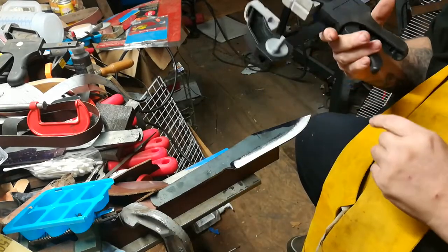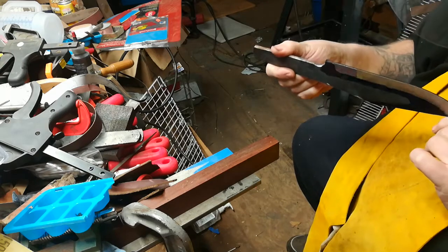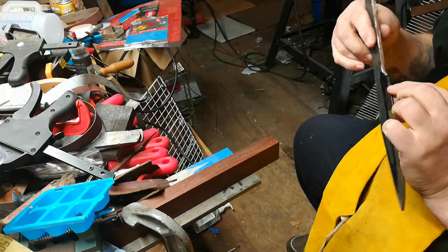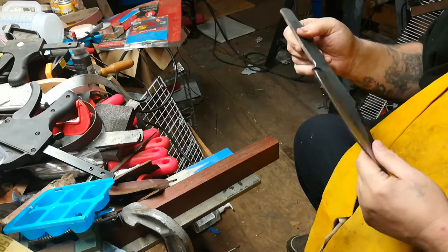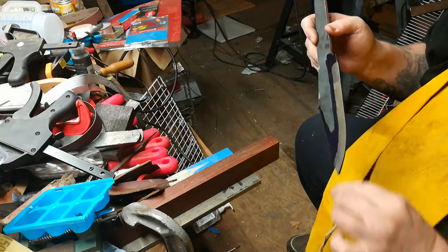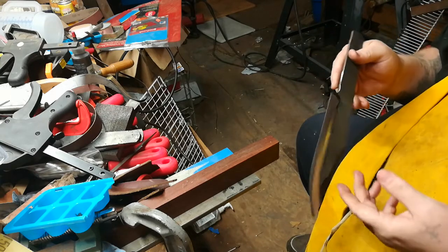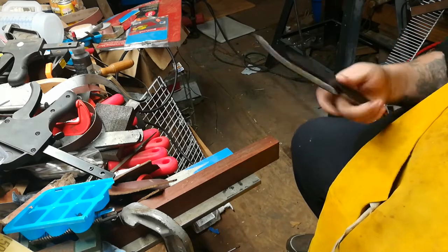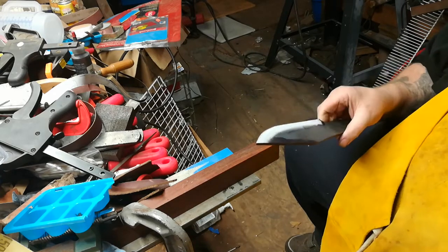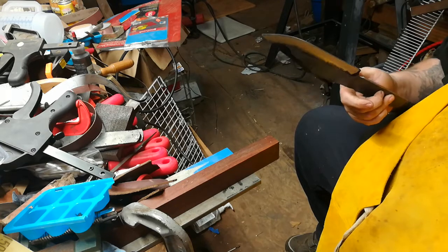Should have a little sticker right there telling what it is, but apparently not. That side needs to... oh, I see — I ground back too far on it. This one here is supposed to stop right there. Well, I kind of messed that up. But I got about the thickness of a nickel, maybe a thickness of a quarter left here. I'll take it down to almost a cutting edge. There's no point in making it super sharp because it's a throwing knife and it's just mild steel from Lowe's — you get like a four-foot bar for like 10 bucks. It's just for learning to use a throwing knife. Practice.